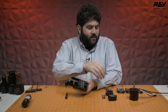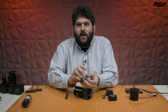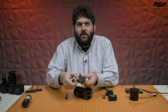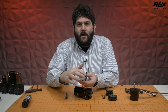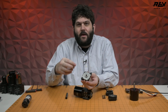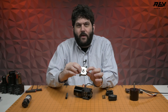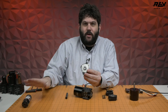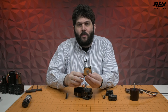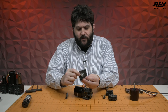The star of this gearbox is the module itself. Each one of our gear stages is fully self-contained — completely sealed top and bottom, and they come pre-greased. That means when you get these out of the package, there's no greasing to be done. You don't need to find small gears and assemble them or worry about placement. These can be treated as a single module, featuring an all-aluminum housing with full CNC steel gears on the inside.